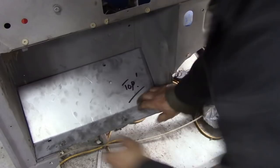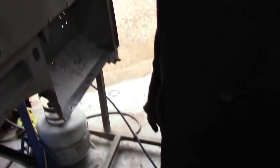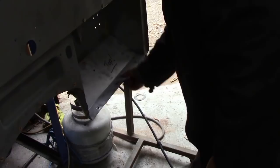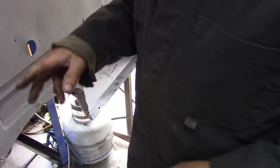So, here we go, what did it look like when they're in? Not bad, you know, little bit of wriggle room. You've got the holes there, they line up nice, that's gonna fit. Let's have a look at the other one. There's a bit of a plastic plug that sticks out there, which should tidy it up a bit. But all the holes lined up, so that's good enough, close enough for farm work. So the next thing I'm going to do is cut those footwells out, clamp these up, tack them in, and then that's done. You know, well, weld them in properly.